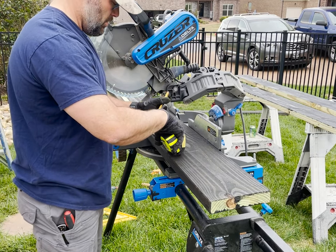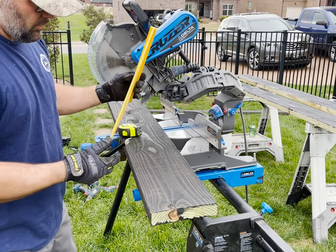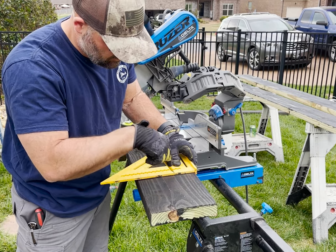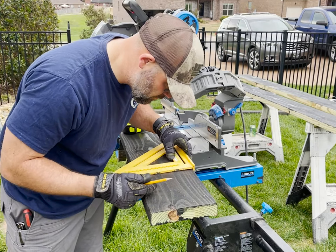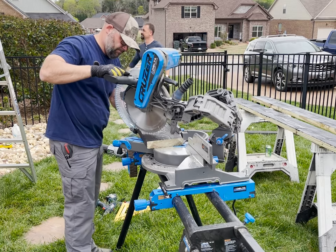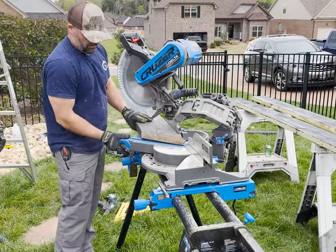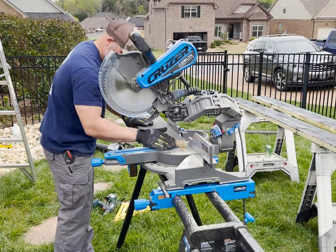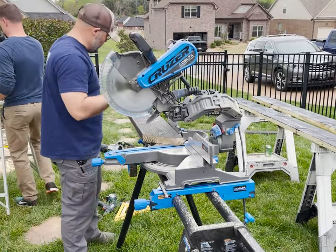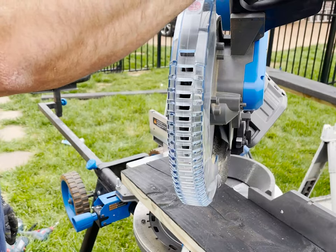With the posts already in place we turned our attention to the headers. I used 2x8s for these and did a header on both the front and the back of the post. To create the crowns I measured and marked a line to designate where the outside of the 4x4 post would fall on the header. From that line I measured and marked a 4-inch overhang on the designated bottom edge of the board. From that mark I used a carpenter's square to mark a 45-degree upward angle to the top edge of the board. Once I had the 45-degree cut I then cut 1 inch off the point, creating a 10.5-inch overhang on the total crown. There are a ton of different ways to complete this overhanging crown look — it just depends on how detailed you want to get and how much time you have.